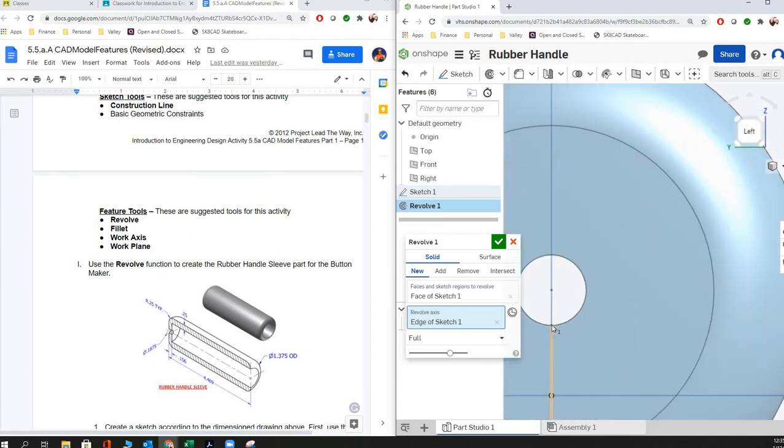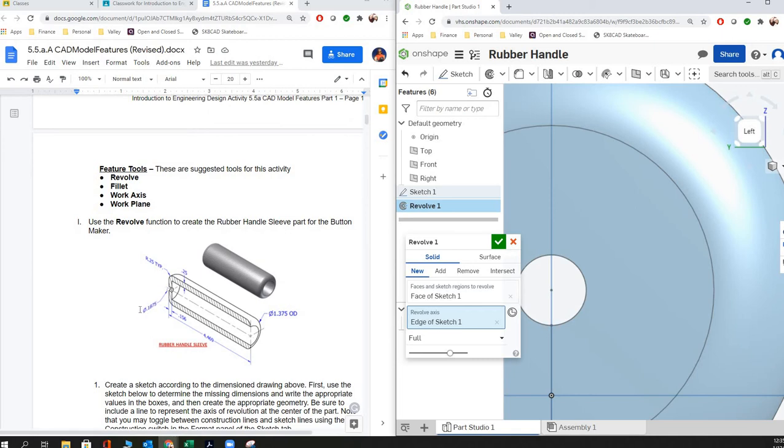If I change the view, you can see our original sketch distances from here to here, and here to here. The reason this is important is because the dimension is given to us in diameter, and diameter goes all the way across the circle, but we're only dimensioning halfway across, so we have to remember to divide that by two.